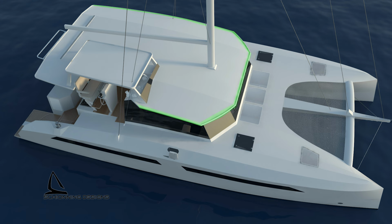We'll have to add a similar trough to this rear section of the top behind the helm, though the rain that collects in this small area will not run forward to the rainwater collection area. To make it so that the rain back there doesn't sheet off, we'll create a tube to take the collection water down to where it will exit at deck level.